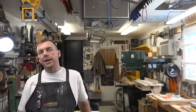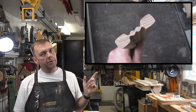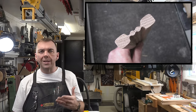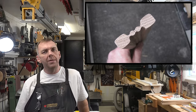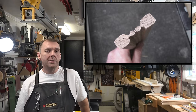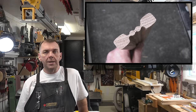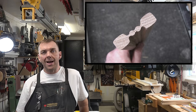Done right at this point in time, you should have a profile that looks like this. You'll see the 2 small balls there in the middle that'll fit together like a puzzle piece with that flat section right between them. This is actually 2 slats of the tambour. This particular bit set utilizes a wider stock, the 1 15/16, to make 2 tambour slats at the same time.